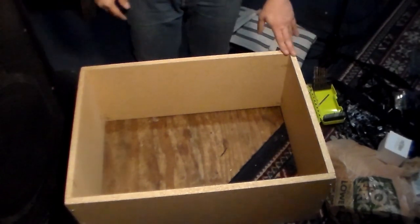This is probably the point where you'd want to paint your box. Consider tin foil or white paint on the inside to reflect the light, and on the outside I'm going with black because it hides on a dark stage and looks cooler when it lights up. You could also paint it with your band's colors, logos, or put LEDs on the outside. Do it now because once you put the plexiglass on top you won't want paint on that, and you want to do it before wiring so you don't get paint on the lights.